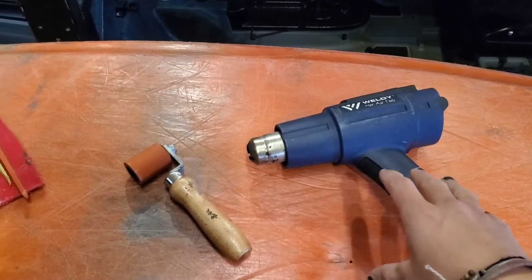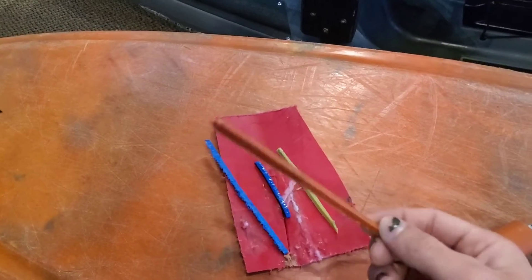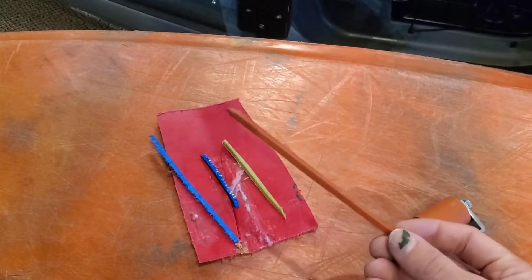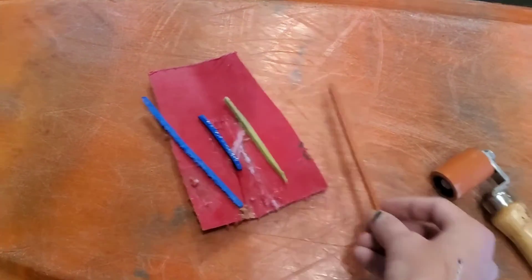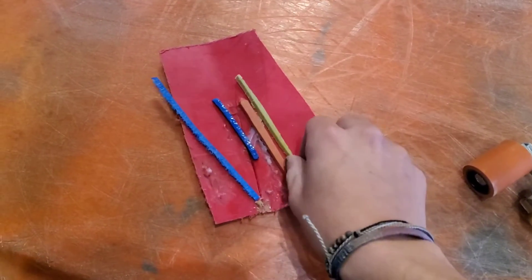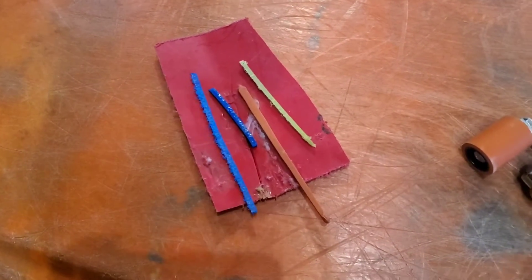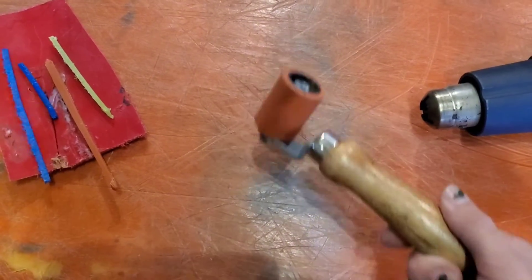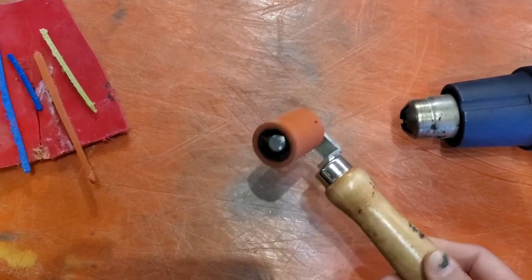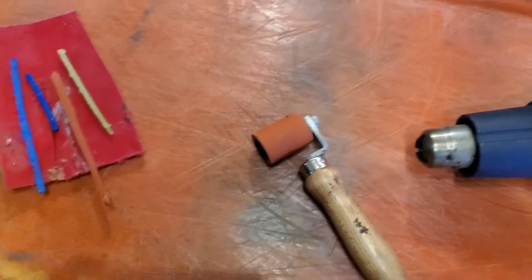Start off with some sort of heat gun; normally you'll have this on the lowest setting. You'll also need some plastic for welding — you can get these off of old boats, from the inside of your cockpit coaming, or just buy a five-gallon bucket. I like using ones closest to the color of the boat I'm working with, or you can spice it up and add a little blue. Another handy tool is something to mash down the plastic when it's warm — we have this handy roller here, but you can use spatulas or similar tools.